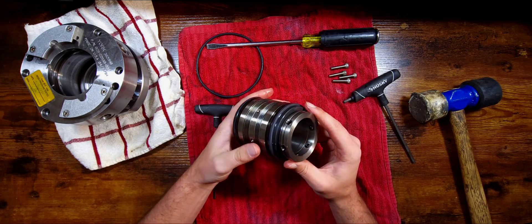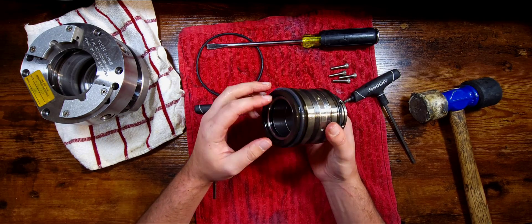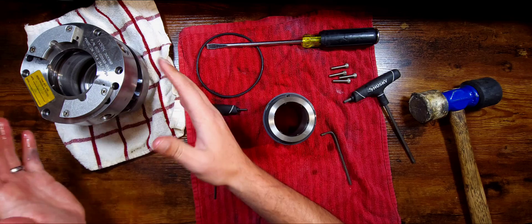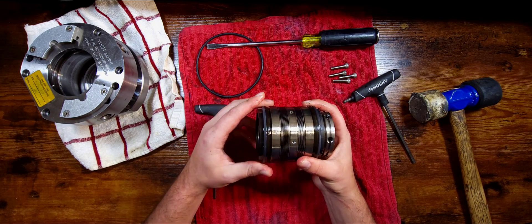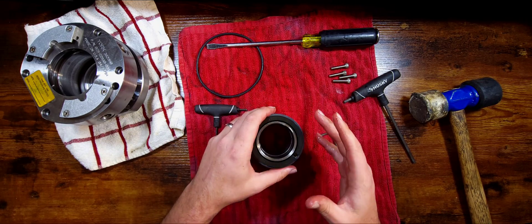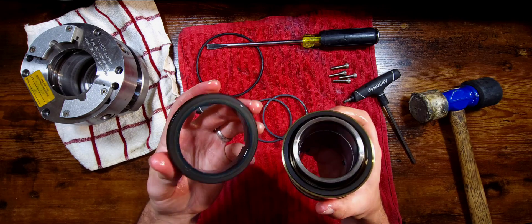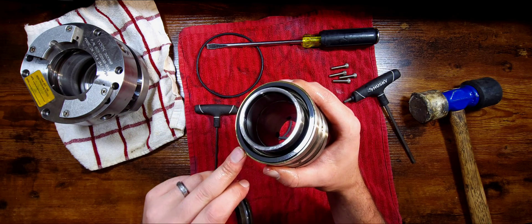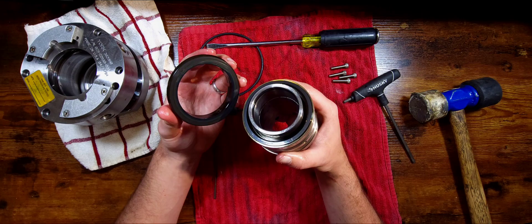With the way they designed these today, I'm doing this breakdown just to show you what is in here. In reality, you don't have to do this in the field anymore. What you'll end up buying — and if you go watch the video where I actually did this repair — you buy this entire housing as one kit, and that's the way you want to do it. Trust me. There are some mechanical seals in here that you do not want to try to deal with in the field if you don't absolutely have to. It is worth purchasing the complete assembly from the factory. This is your inner mechanical seal. This is an actual machined surface, and this is what you have to be really careful with when you're working on this. You cannot make physical contact with this, and this is a big reason why I really suggest you do the kit instead of trying to do this yourself.